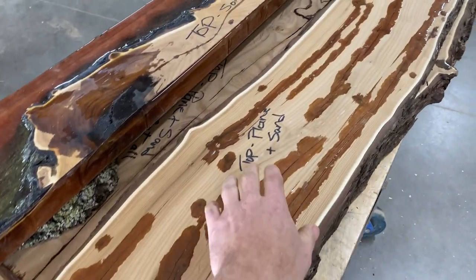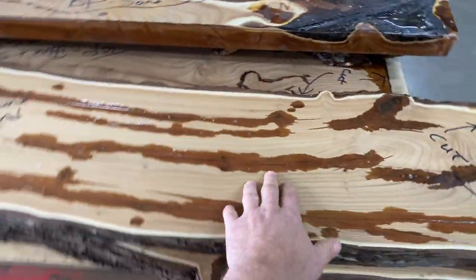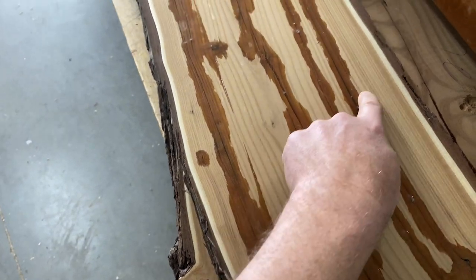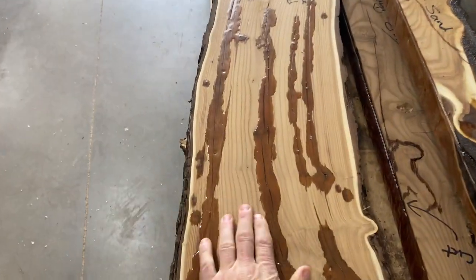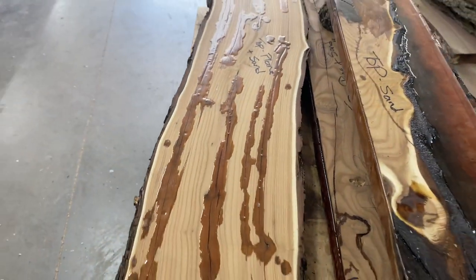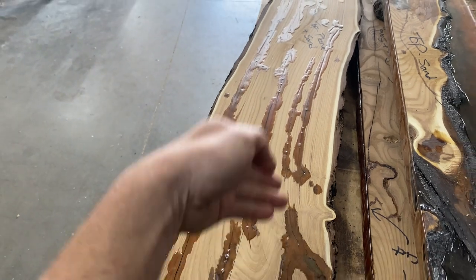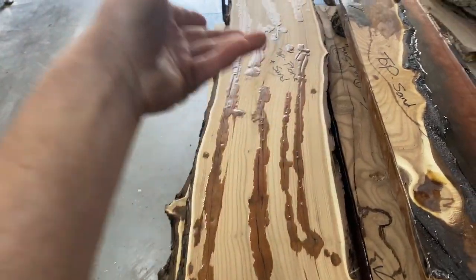This type of board would be very difficult to use for anything because of the micro-cracking throughout it. He actually wood-glued paper to the bottom as his solution. I suggested parchment paper or wax paper next time. But this epoxy is going to go all the way through fully through that crack right to the bottom and really stabilize a slab like this — now it's a slab that's rock solid.